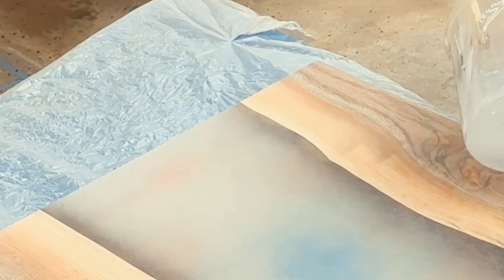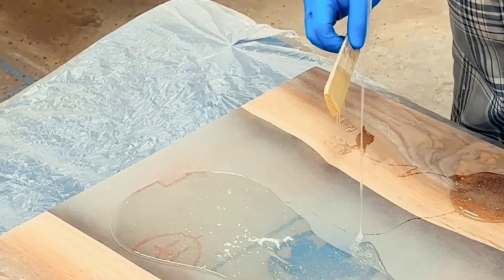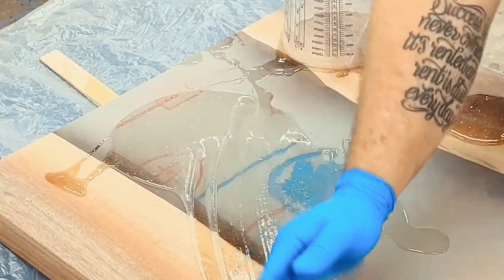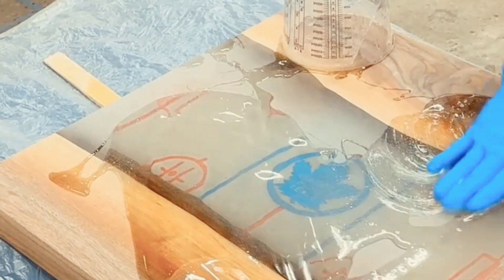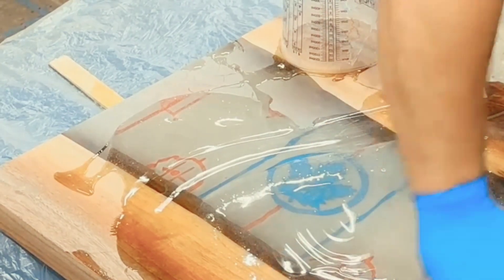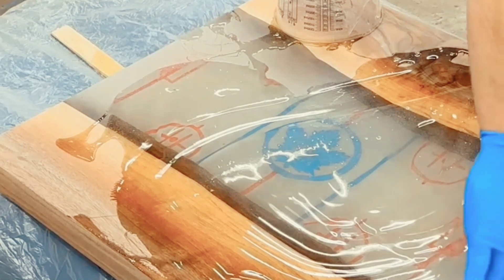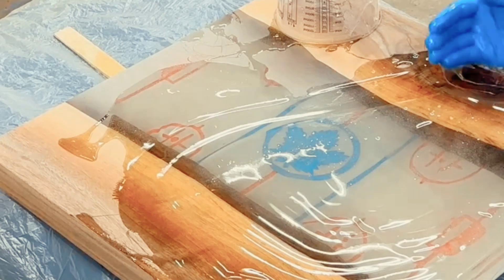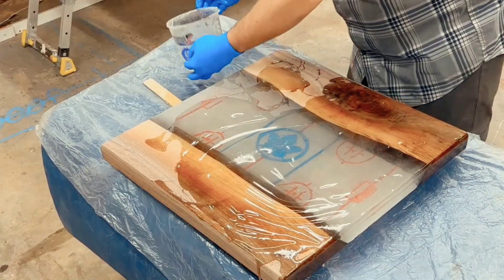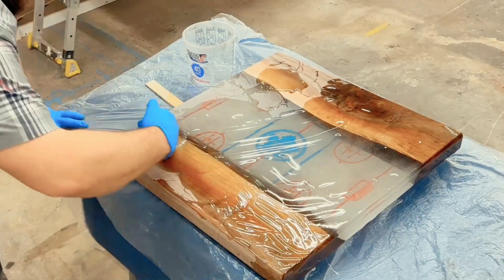It's time to put our flood coat on. I've got a nice batch of flood coat mixed up and I'll put it in a warm water bath to help thin it out a little so it flows nicer — especially since my shop is generally around 55 degrees. I'll put my cup upside down to let the rest drain out, and with gloves on I'll swirl it all around the table making sure to spread it out and cover all the sides and edges — nothing gets missed. It's actually kind of fun, like being a kid again playing with sticky gooey stuff. This is definitely a messy process so make sure you put down some plastic or tarps. As long as you've mixed your epoxy well and covered all surfaces, you'll be good.